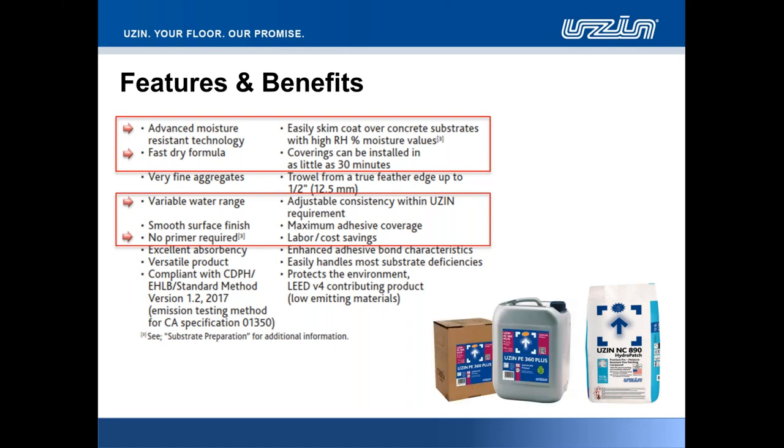The PE360 product that I just mentioned momentarily is shown in the bottom right-hand corner of your screens there, folks. That product, similar to PE260 for our dilutable primer, PE360 is a non-dilutable product. We've done all the hard work there in advance, guys. So it's ready to go. Basically, we literally shake the bottle, pour it into our roller tray or our paint bucket, and then we can dip and go with the roller sleeve there accordingly.